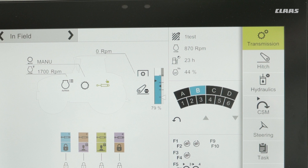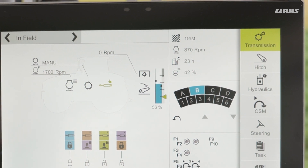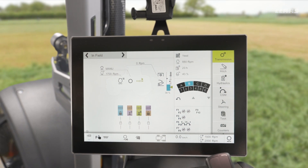Looking at the black dash down to the triangle, the linkage will move between our in and out of work positions. You can see now as we move up to our out-of-work position it stops at the black dash, and once I press my in-work button it moves down to the white triangle, which goes green as I have selected my in-work position. As I move up and down you can see that the padlock has disappeared from the linkage state icon, changing to an up arrow or a down arrow.